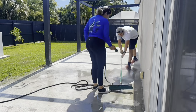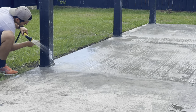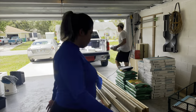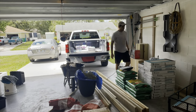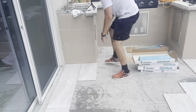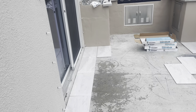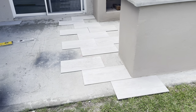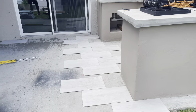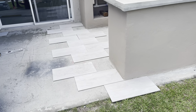You want to make sure the area you're working on is clean and free of any debris. We hosed it down and took the time to remove any concrete on the posts or the floor. We then loaded everything onto the truck to move the materials to the backyard from the garage. We placed the tiles on the floor and played with the layout to see where the lines needed to go. This step is key — take your time laying out your tile so you know how it's going to look when you're done, and where to place your first tile.